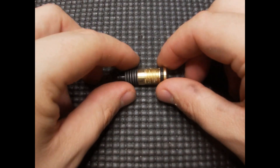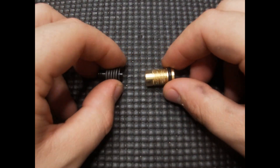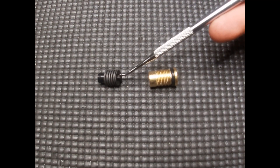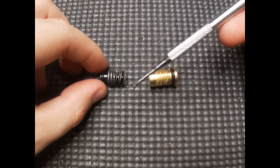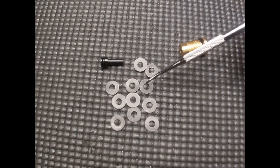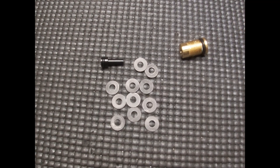First of all, the bottle AMP regulator will have 11 spring washers in total. These are stacked in a cupped formation — 5 sets of 2 cupped together, and then 1 final spring washer facing up, or cupped towards the actual bottom of the regulator housing.